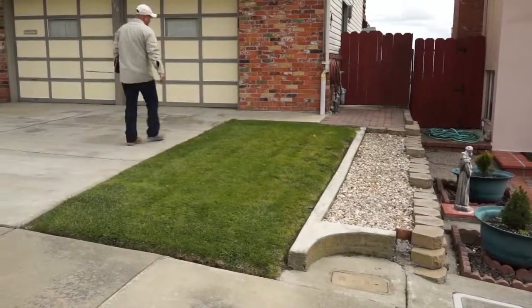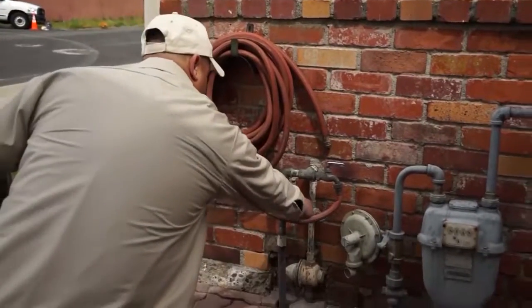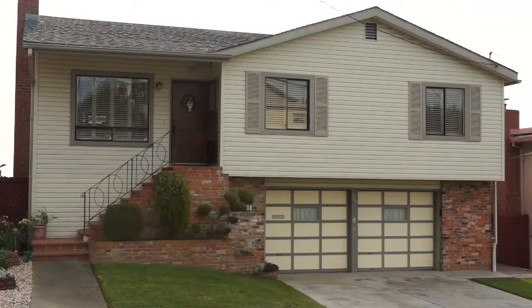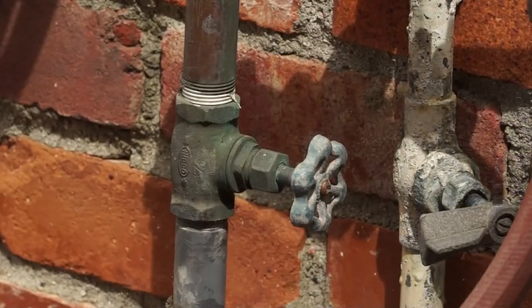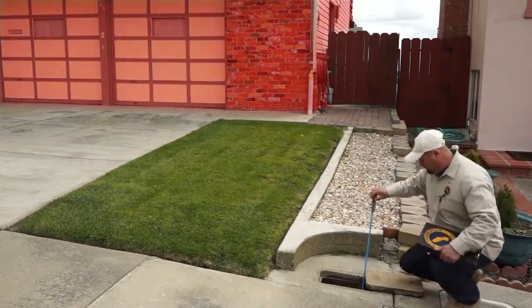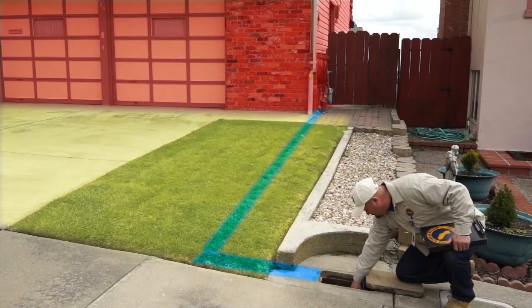To see if you have a leak somewhere on your property, start by shutting off your house valve. The house valve is usually located under the front yard faucet where you attach your garden hose. This faucet may reside along the front of your house, side of your house, or in your garage. Sometimes your house valve may look like this, but it can also look like this. This will shut off all water from the front of your house to the back of your property and will allow you to isolate any leaks that may be occurring between the water meter and your house valve.